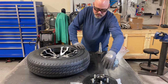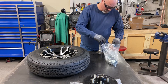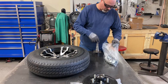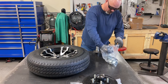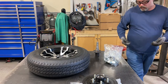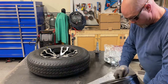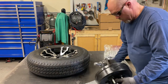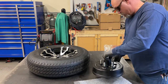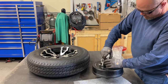Based on the model, I want to have four feet — or 48 inches — from hub face to hub face. In order to get that axle dimension, I want to take a measurement from hub face to where it's got to be welded in. Not only is this the first axle I've ever built, but this is the first YouTube video I've ever put together, so please forgive me for the kind of lame editing and sound — hopefully I'll get better.